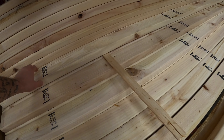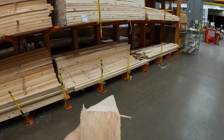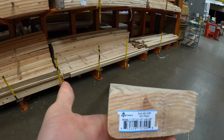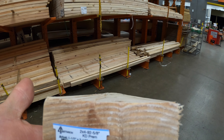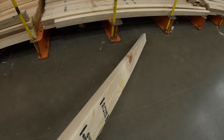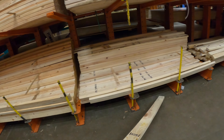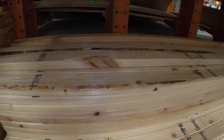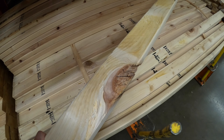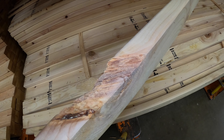All right, so here I am grabbing a two-by-four — I'll grab a nice one out of the pile. I'm going to point the camera straight down the board: you want to make sure it's not bowed left or right facing down the board in either direction. And then obviously you need to make sure it's not warped — if it's twisting or turning in either direction, you probably shouldn't buy it. This one right here looked pretty straight. Also make sure there are no cracks going all the way through. If there are divots or knots that are roughed up, it's up to you depending on your project. Right here there's a big chunk taken out of a knot — I wouldn't buy this board unless I actually wanted that.